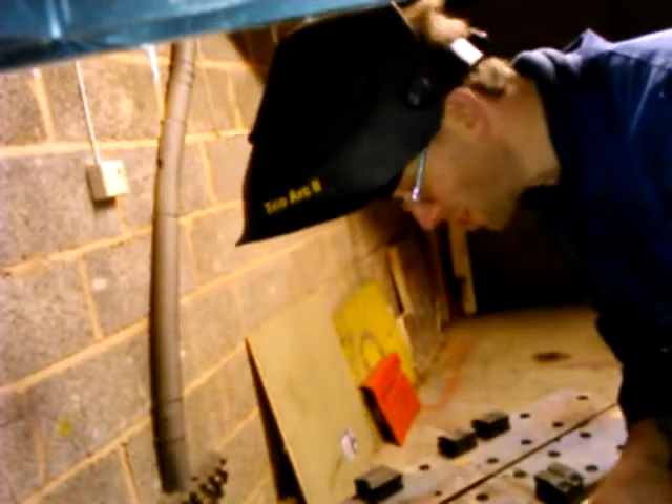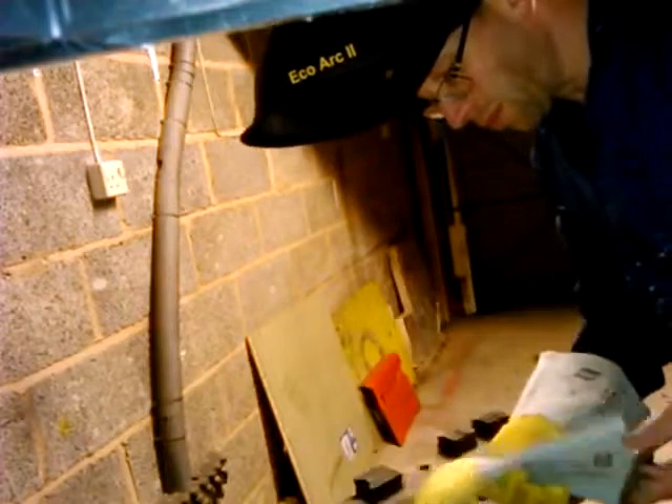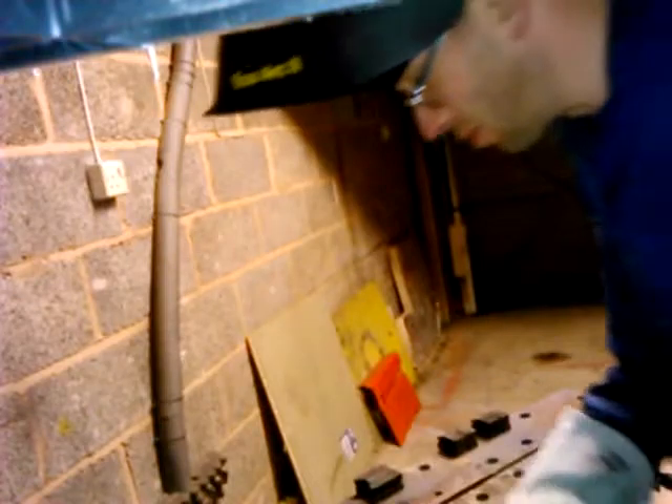It's very important we put the welding mask on because the light is very bright and can blind you, and the welding gauntlets because things get very hot. To complete the electrical circuit we need to put the earthing clamp on - one side of the electrical circuit is the wire coming out of the welding lance, and the other is the earthing clamp which is on my cleaned up piece of metal.